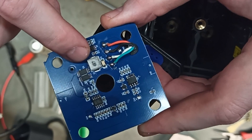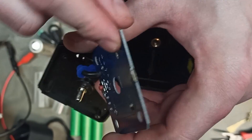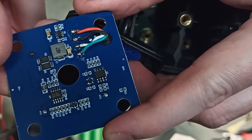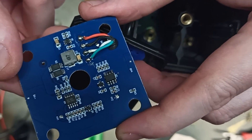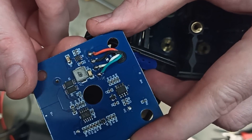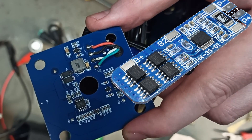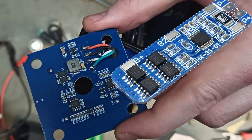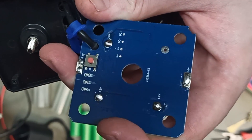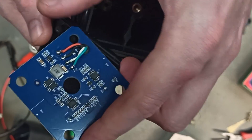There are four wires going out: output voltage plus and minus, DC plus and minus, and a component I can't fully identify — possibly an SS2 connection point. It has a lot of other small components, but from what I can tell this is actually a low voltage, low amp BMS. It's very hard to be 100% sure without actually discharging it, and now I've destroyed it. I think this is still a really good product overall.